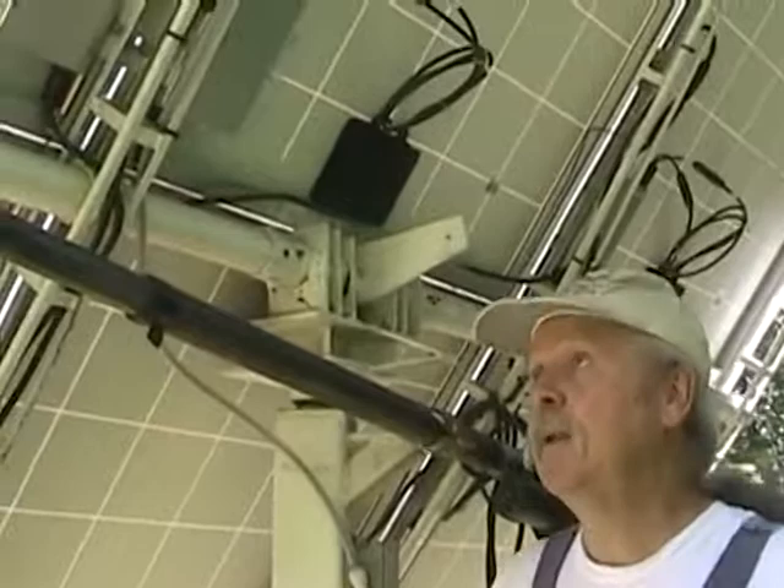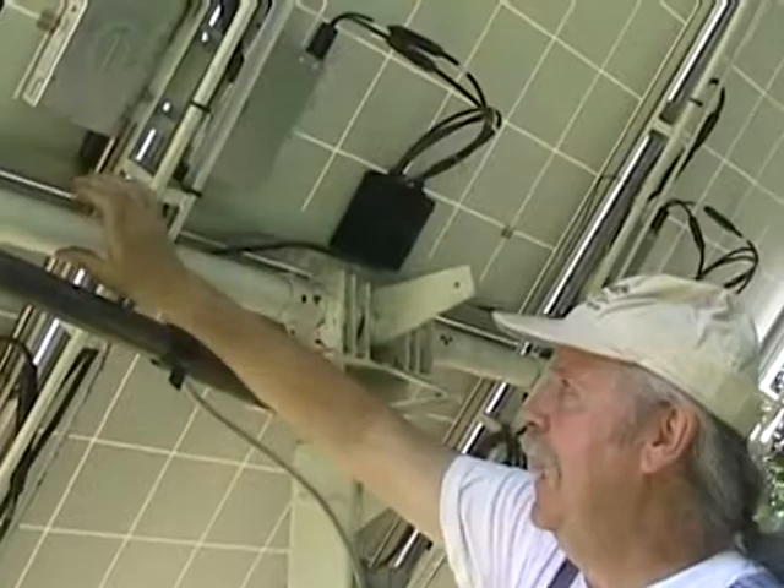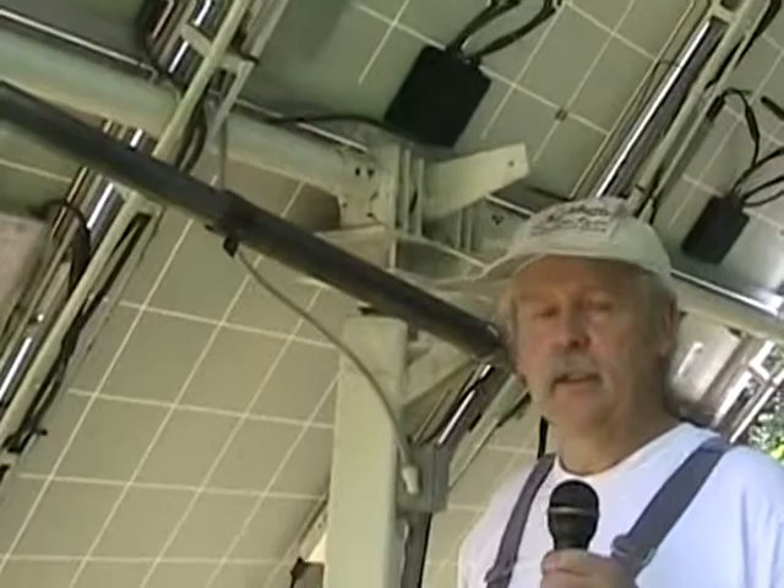For conduit, I used a water pipe that you'd use to hook up your ice maker on your refrigerator. It's all waterproof and easy to do. I've got four wires running up there for the circuit board, which comes down to the motor. I put rings — pieces of pipe — on my trusses, slid them down until I got them right where I wanted, and then ran a bolt through to lock them down. You could just weld it right on, but this way I was able to make the trusses individually and slide them on the piece of tube.